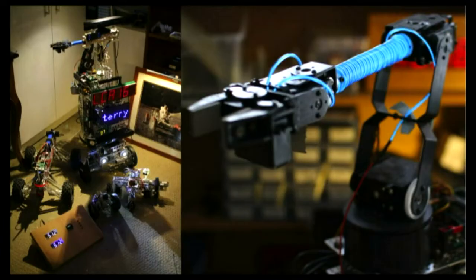On the left side I have a collection of robots I've been working on leading up to the large one, which is roughly about this high, with two Kinects, a pan-tilt system, weighing about 15 kilograms. The two motors on it I had to upgrade — they've got about 10 foot-pounds of torque — because I discovered I'd made the robot heavier and heavier and then found it wouldn't move on carpet anymore.